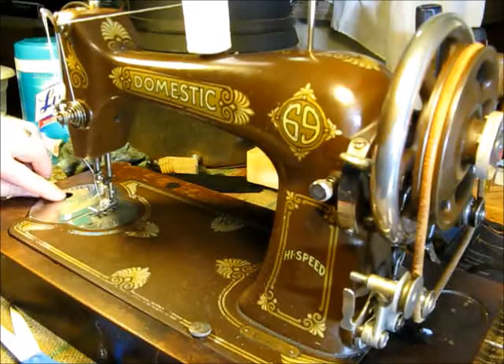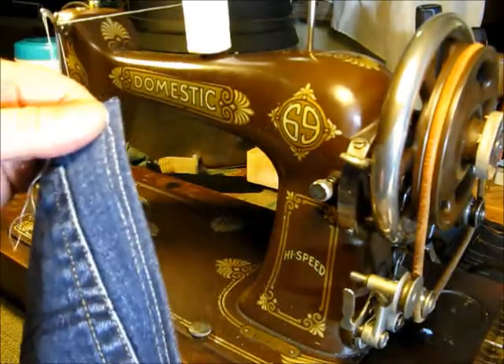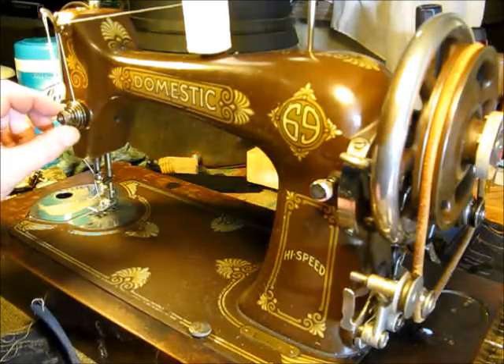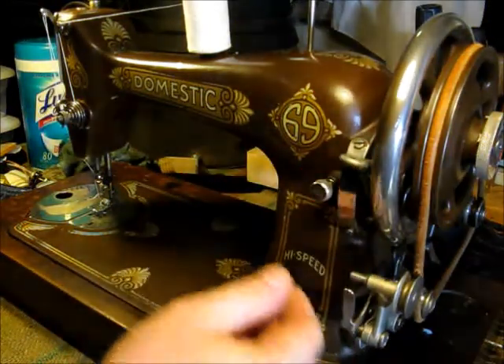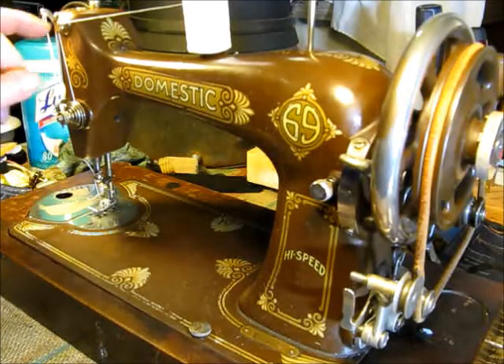This is quite an old machine. It's got patent dates on here of 1918 and 1919, so it's almost a hundred years old. You probably can't see the stitch very well, but it seems to be doing a very nice job. You can see the balance is off — it's a little tight on the bottom tension, so I could tighten up the upper tension a little bit. This is a very basic machine. It's got controls very similar to a Singer of the same era — a forward-reverse lever here, bobbin winder. This is actually a leather belt on here too. This is the upper-thread tension.